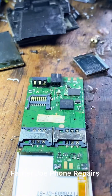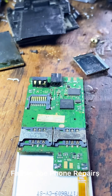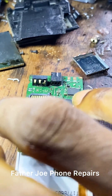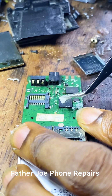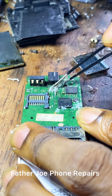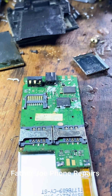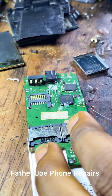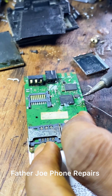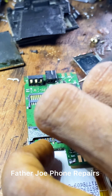To do this I need to first of all apply paste. Check this out — make sure that you apply paste. What I'm going to do here is called IC packing. I'm going to apply something to press the IC to touch the open circuit so the button will work. First I apply paste, and I apply lead so that this will touch the heat sink very well. Take your time to do this, do not rush.